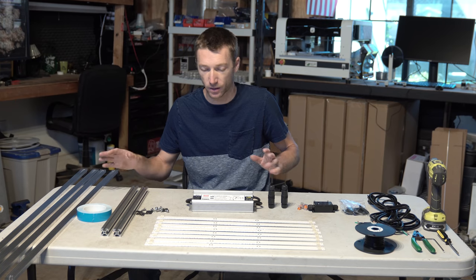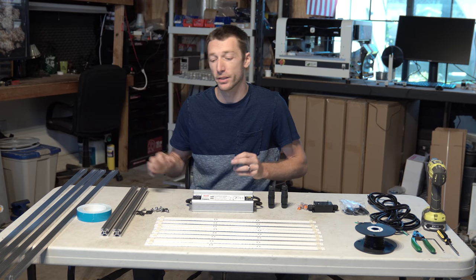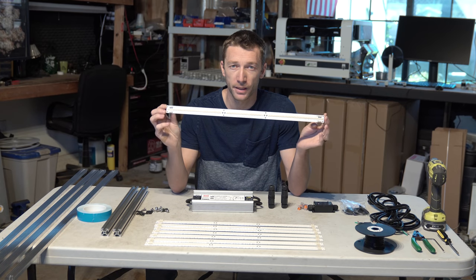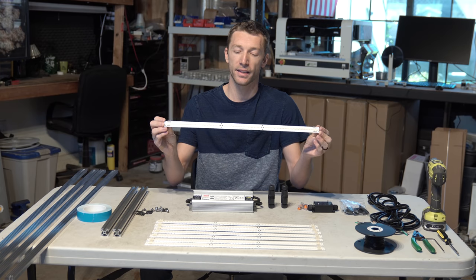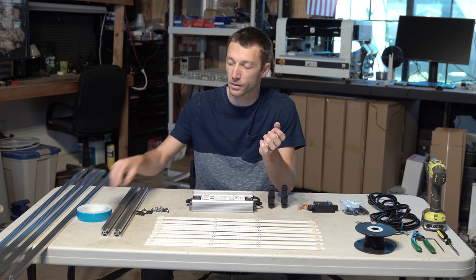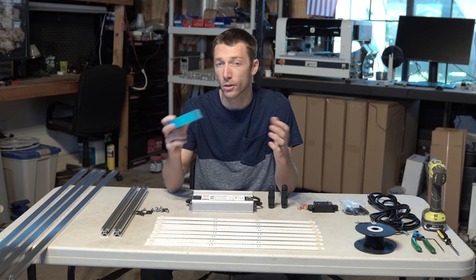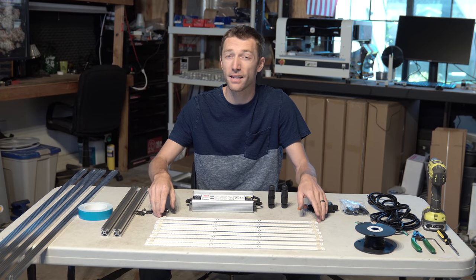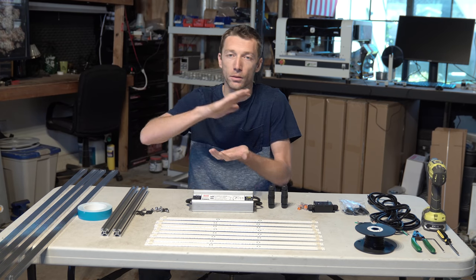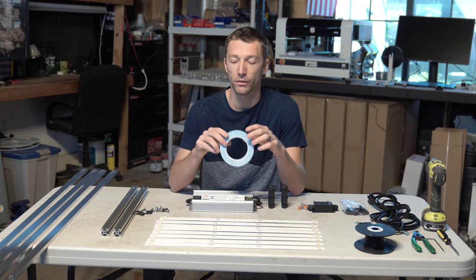So let's just keep moving right on to the next component, and this one, since we started with the boards and then we've gone to the heatsinks, what we're going to need next is to marry the two together. And now the boards, you can find the whole pattern on PacificLightConcepts.com, but truthfully, we're not even going to need it. The whole point of this build is how quick and easy it is, as well as the performance. And both the speed and ease, as well as the actual performance, we have found is better with thermal tape than it is with physically mounting with screws. Now, you could do both, or you could use a high-performance thermal paste underneath, but truthfully, with the adhesive over the full board to create a full mating surface and fill all the air gaps, thermal tape has been the most superior solution we've found.